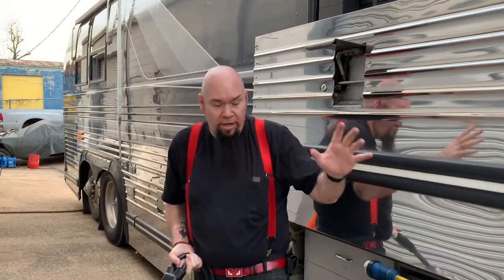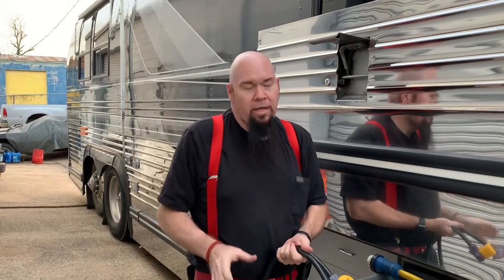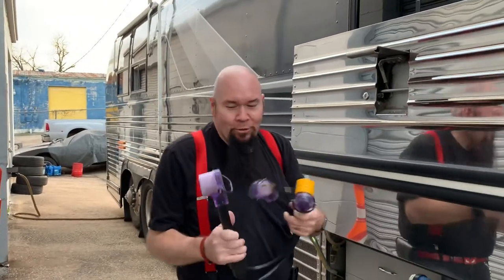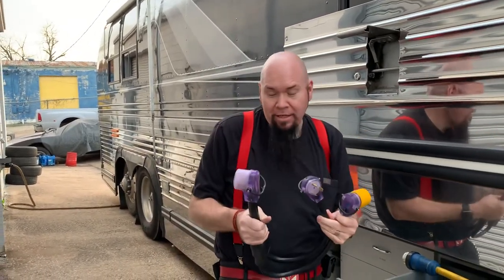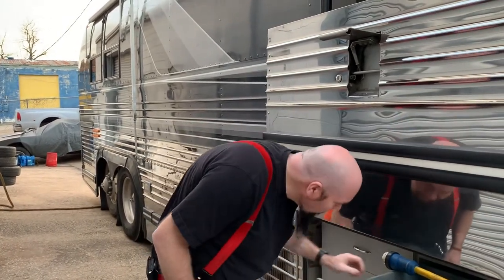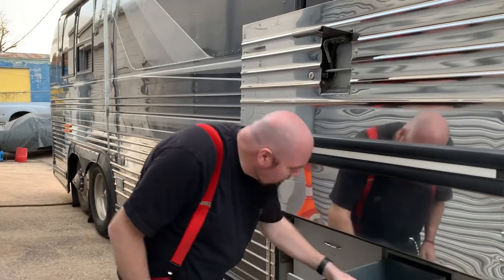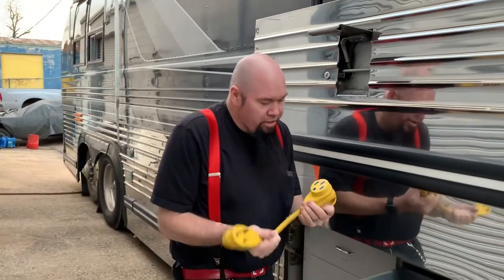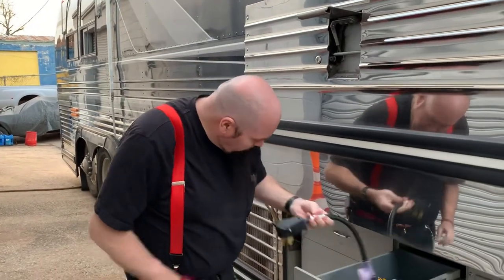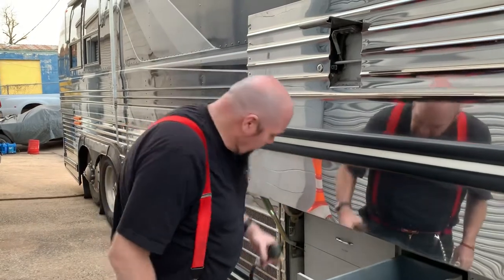You may not be able to run everything, because you're only going to be pulling 30 to 40 amps — but that's plenty. If you find two commercial plugins that have 25 or 30 amps, even better. With 30 amps you can run one, maybe two air conditioners and most of the stuff on your bus or RV. That is a really cool thing to have. I've never actually had to use this yet, but I have it — I'd rather have it than not.